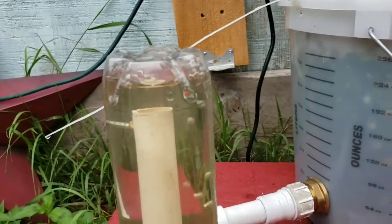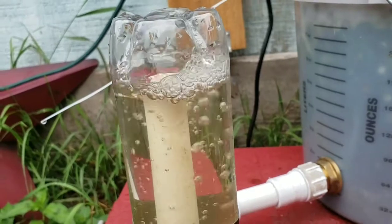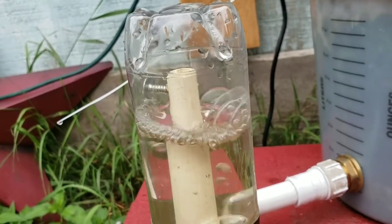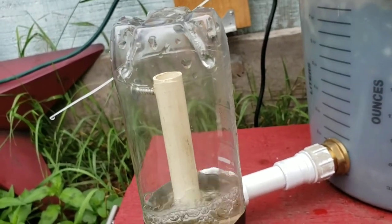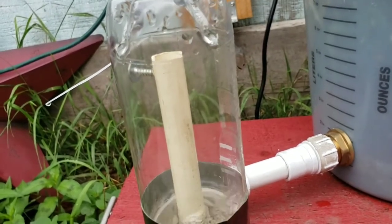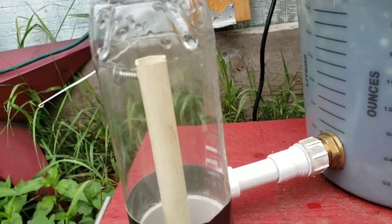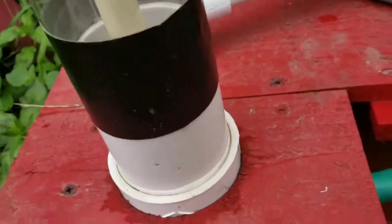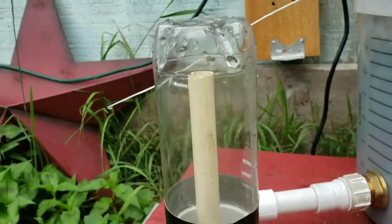Now I've simulated how the pump turns off — the timer stops pumping water, and this is what happens. That is the last bit of water from the bucket. You see what's happening: those are the air bubbles coming out from the bucket, so it's still drawing oxygen down. The pressure is still continuing until that vacuum is clear. Where the water is going right now is the path of least resistance, which in this case would be back through the pump. Now that the pump is turned off it's essentially just an open valve, so the water just runs back down.